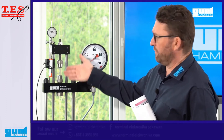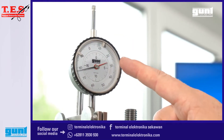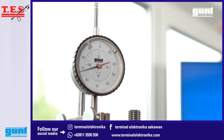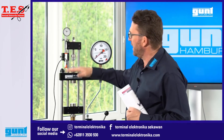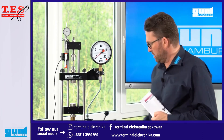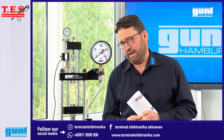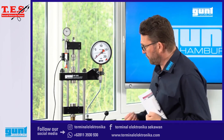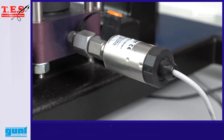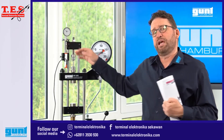The elongation of the specimen is measured by an adjustable indicator up here, which indicates the relative displacement between the top crossbar and the crosshead of the unit. When using the Gunt data acquisition system, the test force is calculated by the system software via the measured system pressure from a pressure transmitter down here. The elongation of the probe is measured by an electronic displacement sensor.